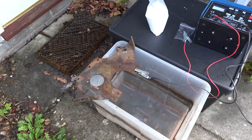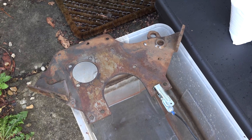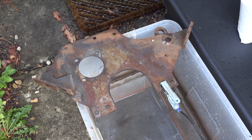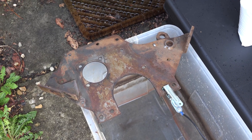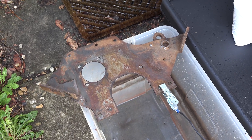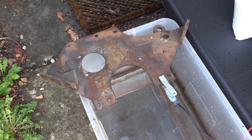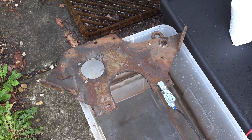What we're going to use is the front plate off the engine. I'm just giving it a quick go over with a wire wheel, but it's still got a bit of grease and some paint on it. I want to see what level of prep you need to do with electrolysis - whether you can just take a piece like this, pretty dirty and not fully cleaned up, and whether that will still work.